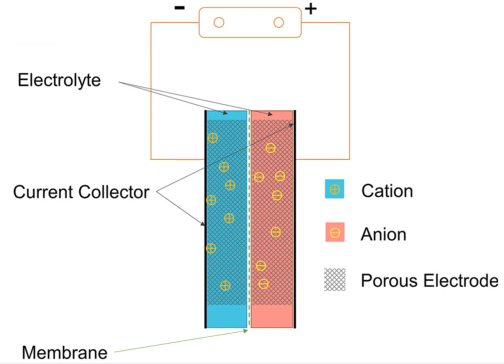A supercapacitor (SC), also called a supercap, ultracapacitor or gold cap, is a high-capacity capacitor with capacitance values much higher than other capacitors but lower voltage limits that bridge the gap between electrolytic capacitors and rechargeable batteries. They typically store 10 to 100 times more energy per unit volume or mass than electrolytic capacitors, can accept and deliver charge much faster than batteries, and tolerate many more charge and discharge cycles than rechargeable batteries.